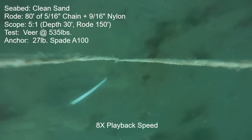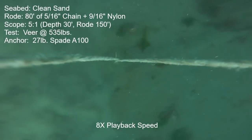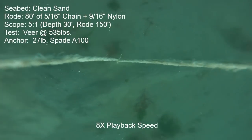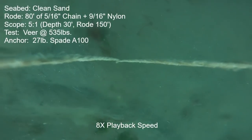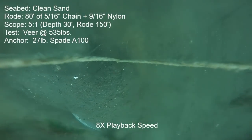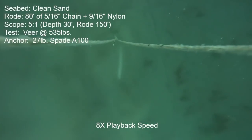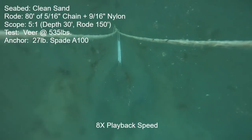This anchor is the aluminum Spade A100. I include it with the larger 45-pound range anchors even though it only weighs 27 pounds, because it is the same physical dimension. The anchor did dig in right away and began the first part of the veer just fine. However, I made a mistake — I was only pulling at 500 pounds baseline — so it got a break there, but the anchor released anyway. In the straight-line portion the anchor had a full release at 1,020 pounds. I take that into account in the rating.